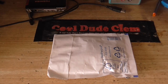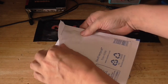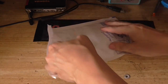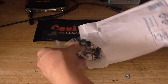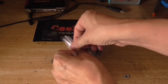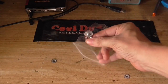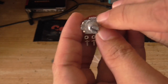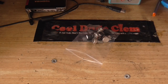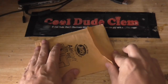Let's see what's in this one. I think this is going to be my logarithmic potentiometers. Yep — let's just get one out, make sure it's got an A on it, not a B. Yep, it's got a little A right there. It means it's log. Because if you're doing things like analog volume controls and stuff like that, you want to go with log, not linear.